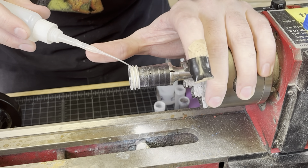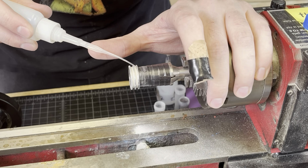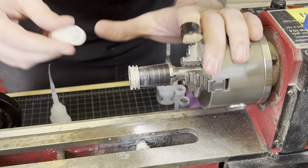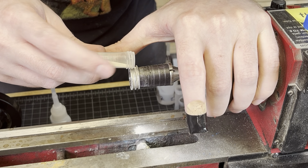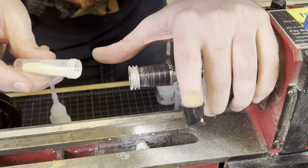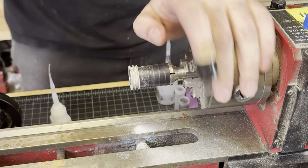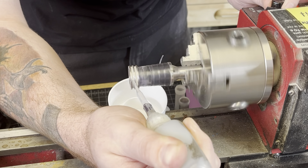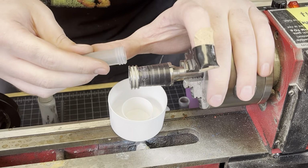That way it doesn't get obstructed by the pigment, and the grayish color of the obsidian will darken that pigment anyway. Once I put that pigment on, I'm just doing a small layer of the thin CA to just barely wet down that pigment to hold it in place. And then I'm also just fixing a little patch that I missed when I was putting it on.